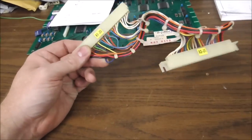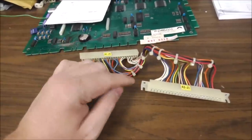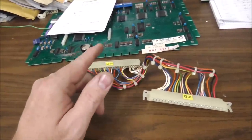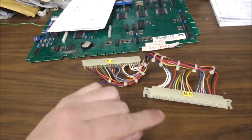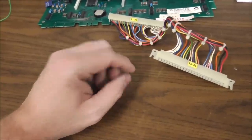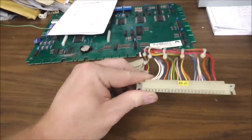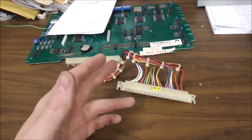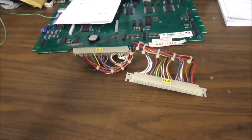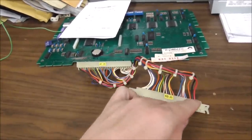You can buy these too. Like I mentioned in either this video or the other video, you can actually buy these that have diodes in line if your driver board doesn't have those diodes. But here's the thing. The outhole doesn't connect through, but the drop target one does connect through. So the drop target one, since that part of the board uses a pre-driver and the big 2N3055, I think it's probably just one of them has something wrong. So after I get this right, we're going to put it back in and test it again just to make sure that the drops don't work then. And if they still don't work, I'll pull the driver board out and we'll look at those two transistors again. One of them must be bad, or a resistor or something's not working right. So I'm going to start replacing the pins on the wires.